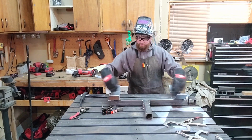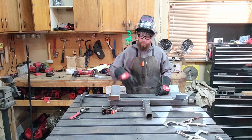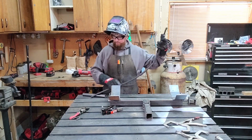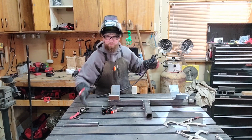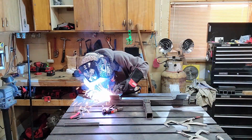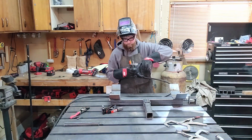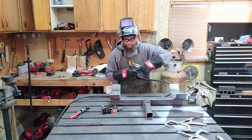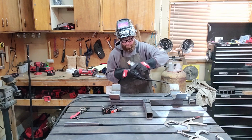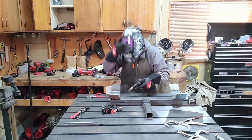We're gonna weld up our cut edges. That way we can make sure they don't break later on. Okay, so we're just gonna do some welding here. And this stuff will probably speed up because I don't know how interesting it would be. Maybe. Always gotta stop once in a while, clean that nozzle out. It's gonna get lots of spatter. I'm gonna do across here now.